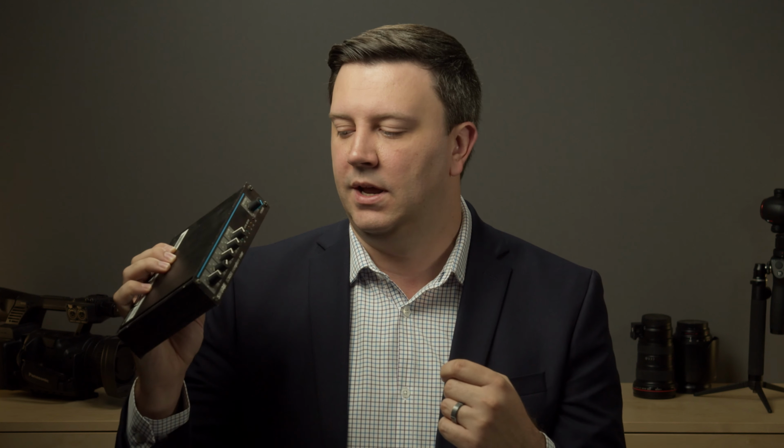And you might say, well, on the camera I have level meters. That's right. But individual meters here help you troubleshoot problems between the mixer and the camera. So if your camera is reading one set of audio levels and your mixer is reading a different set of levels, then you know there's probably something not set between the two correctly. Also, your camera's level meters are probably the most important ones because that's what's actually being recorded. But it's also really helpful to know what's going on here.